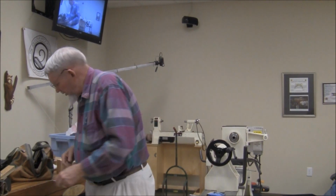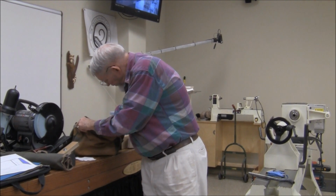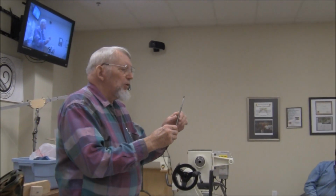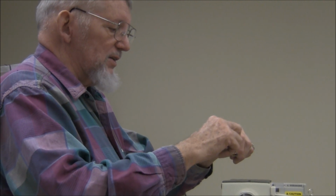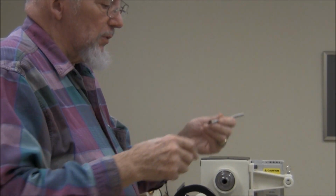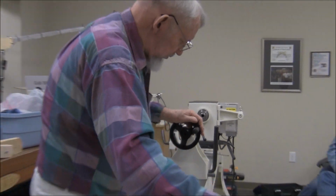And if you're making the tool, you need to cut your tool bit that long, because for silver solder, you need to have pretty good fitting joints. And to clamp all of this and leave some space in here to get the torch in, make them that long. When you get them glued up, take them to the grinder and cut half of it off. That's way too long.